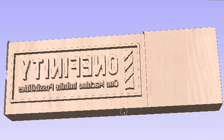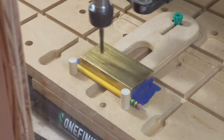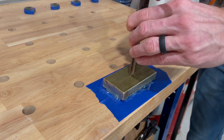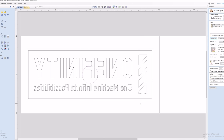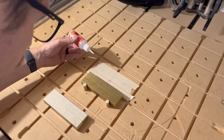The last toolpath I'm going to do is going to be on the other side. Obviously, I'm not going to try to handle a hot branding iron with my bare hands, so I've got to find some way to attach it to some kind of post. So I decided to create a hole just slightly smaller than a half inch diameter and tapped the hole so I could thread in a half inch diameter machine screw. I toolpathed it with a quarter inch O-flute upcut bit for my pocket toolpath, cutting a hole 0.453 inches in diameter, three eighths of an inch deep. 0.453 may seem like an odd number, but in order to thread a hole for a half inch screw, that's the size it needs to be. I ran it at 80 inches per minute with the spindle at 12,000 RPMs, cutting just one thirty-seconds of an inch deep each pass. Okay, we have our toolpaths programmed, so now we can save them and bring them over to the machine.